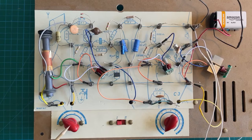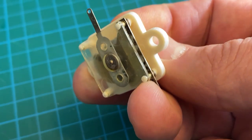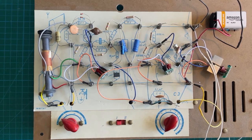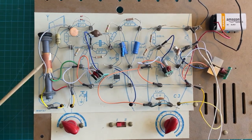This is one of those plastic tuning capacitors, mounted on the underside of the board. And this is the on-off switch volume control, of course. This here is just a little DPDT slide switch, which is not used in this build — you could use it for on-off or selecting things, but in this circuit it is not wired anywhere. So, without further ado, let's turn on our three-transistor receiver.